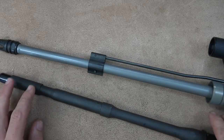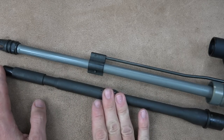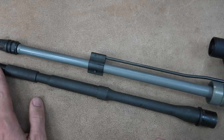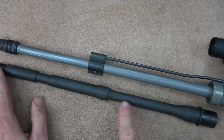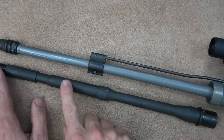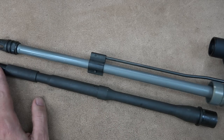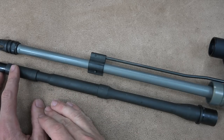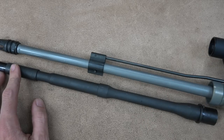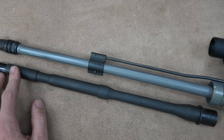To give you an idea of the barrel profile, I have an M4 barrel here for comparison. The Hanson series gives you a mid-length gas system, whereas this one is carbine length. What you'll see is that the section under the handguard is actually a little thinner on the M4, but forward of the gas block it has a thicker portion — .75 inches on the M4 versus .625 going forward on the Hanson. On the end of the rifle where you don't want weight, the M4 and government profile barrels add a lot — and back where you want rigidity and heat dispersion, they don't have it. So M4 and government profile barrels just generally don't make a lot of sense.